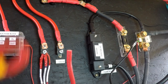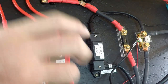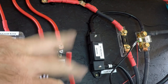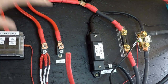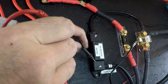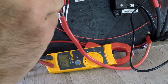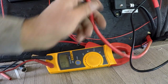There is one final thing - this was live because it's coming from the distribution panel forward. With the charger supplying 12 volts to it, that's why I hadn't messed with it. I didn't want to make any of this live until I was ready. Before we do that, we want to make sure there is no power right now. Survey says - I'm seeing no power. Going between positive and negative, there's no power. So we're good to start working on that and getting it hooked up.